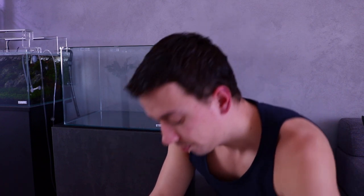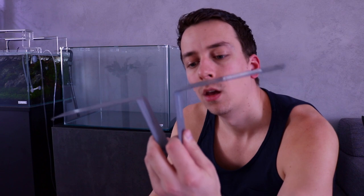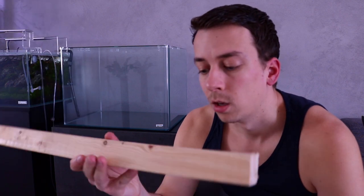I have four of these pillars and I'm going to put one in every corner. This will make it a lot stronger, really reinforce the cabinet and stop it from wobbling. I also have this cross-brace piece — no idea how you call this in English — but this is going to go on the bottom in between the four legs just to make sure it doesn't collapse in the middle. These pillars need to be 58 centimeters, and this piece you can just buy at IKEA.